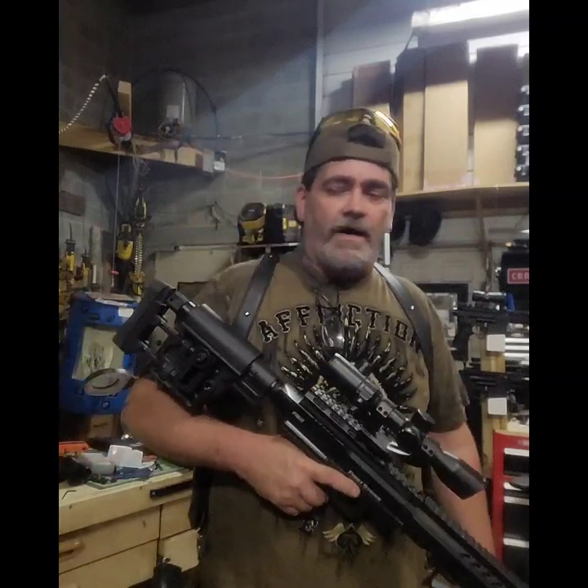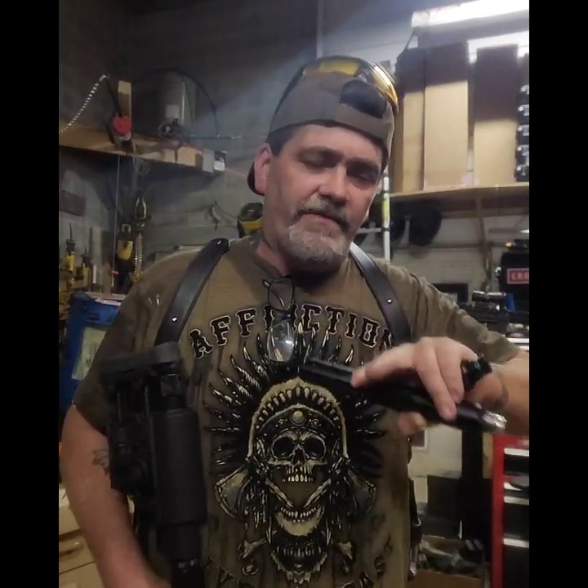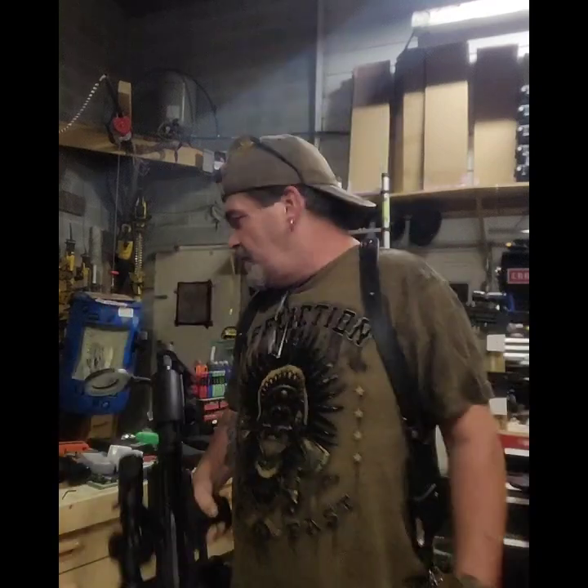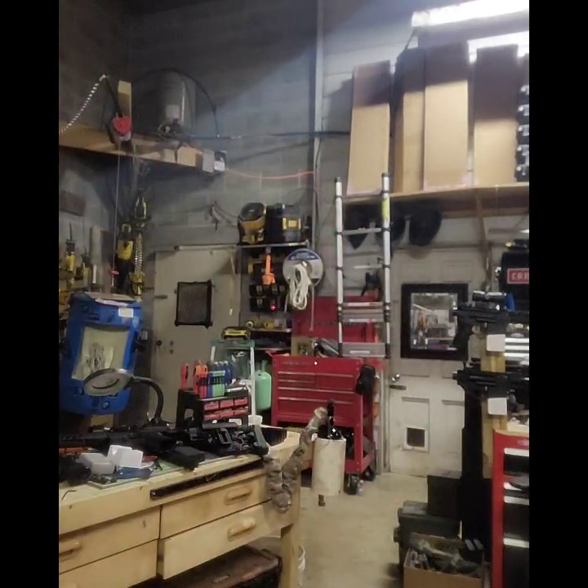Super upsetting. So what I figured it was - they were off on their thread counts and it wasn't getting the distance to pierce either or both of the CO2s. So I jumped on the CNC mill real quick and milled out a little circle of plastic, kind of like a washer, to bring up the distance a little bit and dropped it in between the two - to bring them both closer to their piercers. Put it all the way in and still nothing. So I took it apart to look at it.